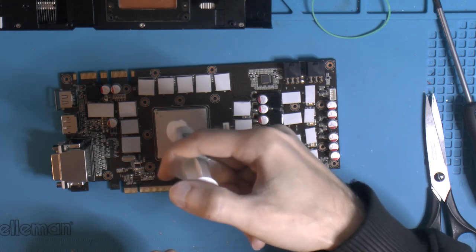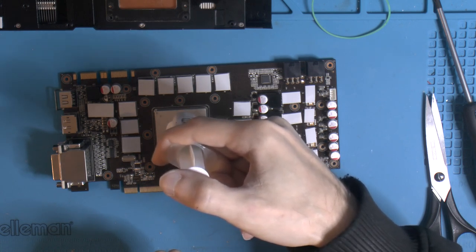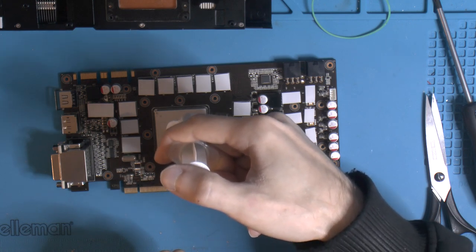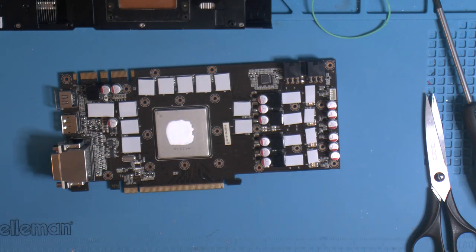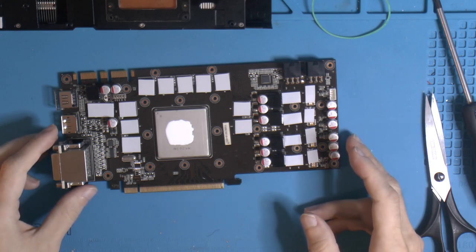I know a person who does this to like 200 series, and also I think the 8000 series, and puts liquid metal underneath, so you can do that if you wanted to under the IHS. Then it might make more sense to use some fancy paste on top, but since it's basically like an old Intel CPU with TIM underneath, it's really not that important, I find, or think. And obviously, better paste is better paste, but it's not gonna make the big difference.